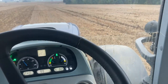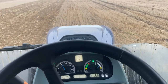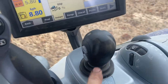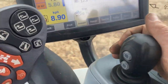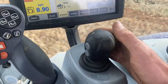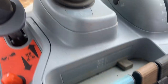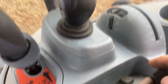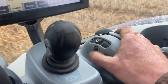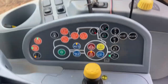There we go - a brief overview for the guy who asked me. I can't remember who you were mate, but I hope that answers your questions about this joystick. This one can also be for spool valves, programmable again - various different buttons to do different things. You can do all four spool valves. If you look on the front here there's a little knob - you press that, you can go forwards and backwards and do valves one and two, left and right, and then you can press the button and do three and four. That is all programmable from here. And then you've got this here which is basically up and down and draft control, and you can also lift the three-point linkage up here as well - you can lift it here, here, or here, but that last one's not recommended, that's more for when you're hitching an implement.